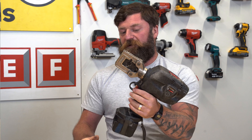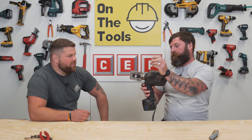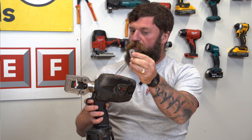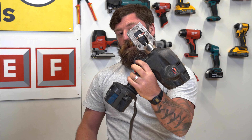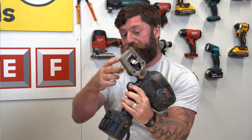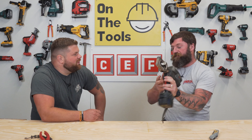Tool number five. So if we had Emu, we went along the theme of birds in children's shows — it's a big bird, it's a big boy. That's got some weight to it. I use this to cut cables. With the steel wire armoring on, the amount of time it saves you — because if you're using a reciprocating saw or band saw, you've got a chance of the cable twisting, snagging, and biting onto the blade. Whereas this just goes through it like a hot knife through butter. That was my tiny toolbox tour — my five essential tools that I can't do without.